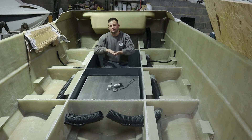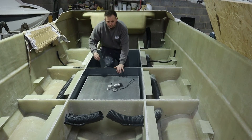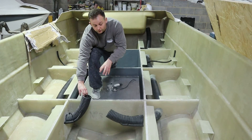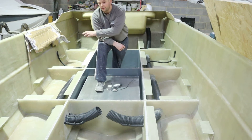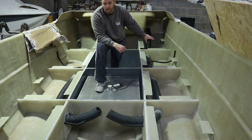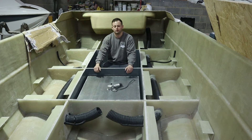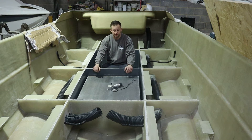As you can see, we've got our two main longitudinals and the bulkheads going out to the sides. We've got our rigging tubes which you can see down here, which come up through into this compartment, through the deck and to the inside of the console. We've also got some smaller conduit on the sides and up the gunnel. We're going to be running four speakers off this, tucked into the gunnel, so this is just to run the wiring up through and into the console — less faffing about later on, keep it all methodical, and if anyone wants to rerun the wiring in future it's all there ready for them.